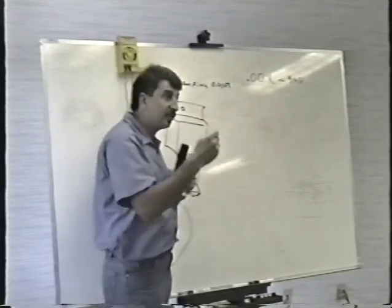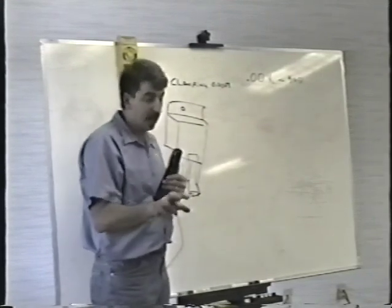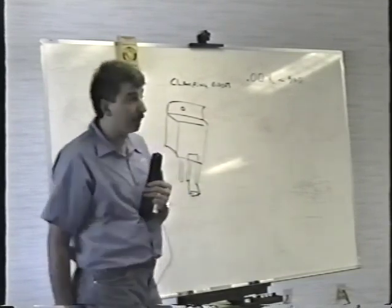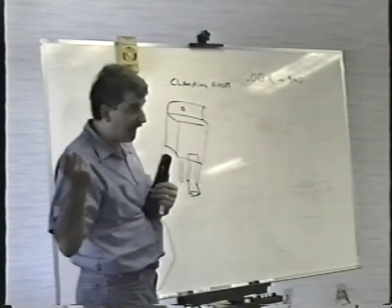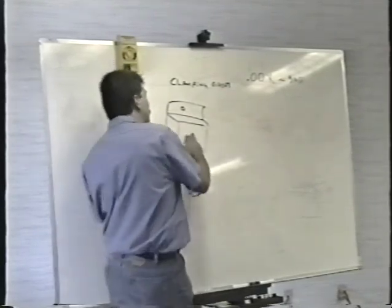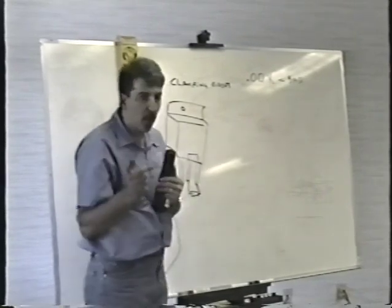When you pull the transistor out of circuit, double check the transistor. If you find it to be good, the clamping diode is your only problem. Put the transistor back in and take the diode out and replace it. On the other hand, you may find the transistor and the clamping diode are both bad.